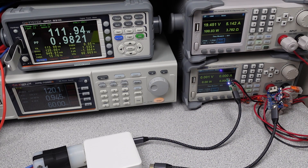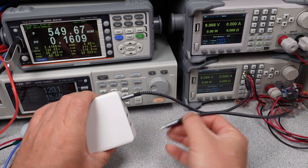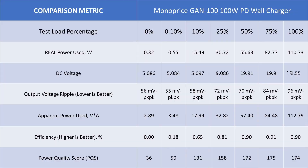The power negotiation is the same as most USB power adapters — any plug or unplug causes a renegotiation of all the outputs. The data on this one is, well, beta. It isn't bad efficiency-wise, but it isn't great either. And beyond the size, there are far better options out there. The idle is too high, and the poor performance shows the lower efficiency of the circuitry. The voltages on the output side were stable though, and the ripple was relatively good.